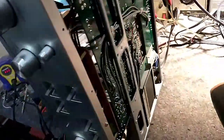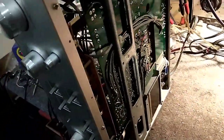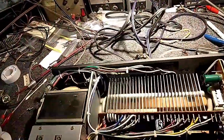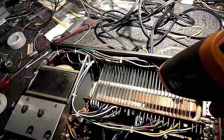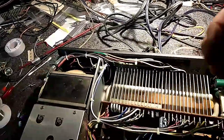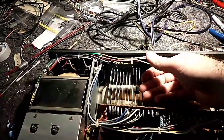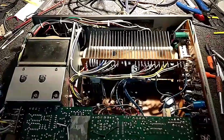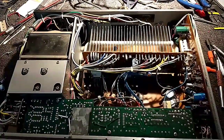So the cooling is not doing its job. Obviously 60 degrees centigrade on the set of transistors and only 40-45 on the heat pipe ain't gonna do it. The more you crank this thing up, the more chance there is the outputs will blow long before the heat sink can alleviate the heat. What do you do about it?